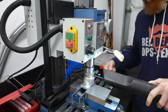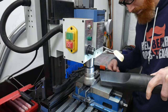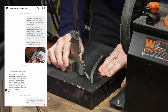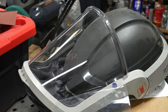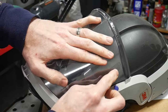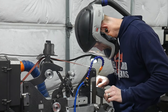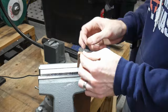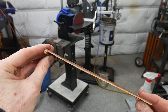The ledge I made on this jig ended up being too thick, which restricted the height of my primary bevel. I threw it back into the mill and took the ledge down 68 thousandths, which still ended up being too thick. I talked with Tobias on Instagram and he recommended using a one to two millimeter thick piece of sheet metal bent at a 90-degree angle, then grinding the center down to around half to three-quarters of a millimeter — about 30 thousandths of an inch. I plan on trying this method again in the future with a newly modified jig. To get some slight convexing and a smooth finish on the bevels, I made a leather backer for my platen; combined with the J-flex belt, this worked pretty darn good.